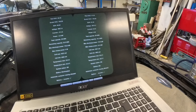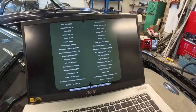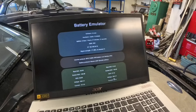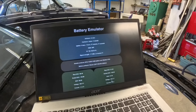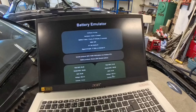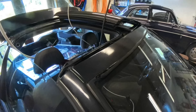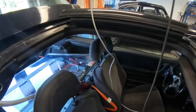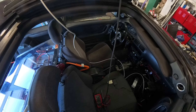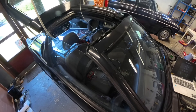There's also a red indication here that it's not allowing for contactor closing. If this were a CAN-controlled battery with CAN communication turning it on and off, it would be automatic when the voltages match. But since this battery is not CAN-controlled, I'll just flip that big main breaker once it's ready to go. So now I'll spend some time waiting until it equalizes.